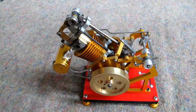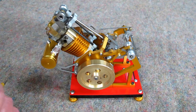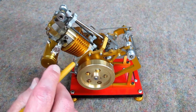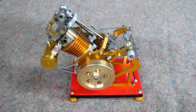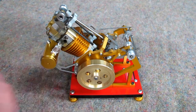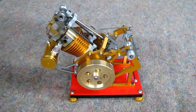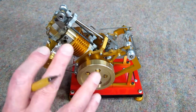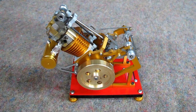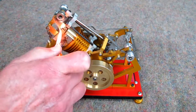This one does not coast like a Stirling engine does. What do I think of this engine? It's made well. Once you get it up to temperature and get it running, it runs consistently and runs well. You may have to play around with the timing to get the reed valve closing at the correct time — if it's popping, spitting, and backfiring, it's out of time. It's a fun engine and a very good demonstration engine; not everybody has one of these. It hasn't run for a few minutes — let's see if it'll start again.